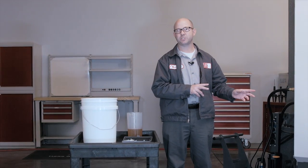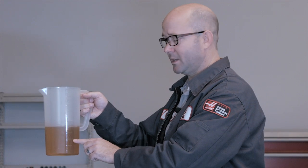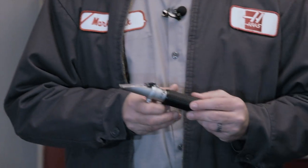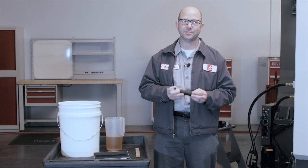So it's time to make more coolant for our machine, but at what concentration? How much concentrate do we add to our top-off buckets? A little more than last time? A little less? This is where we're going to need our refractometer to measure the current coolant concentration of the coolant that's in the machine. You can pick up a decent refractometer for around $25. They're available online and at homebrew supply shops and they're really easy to use.